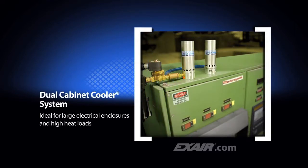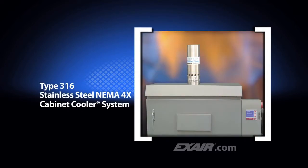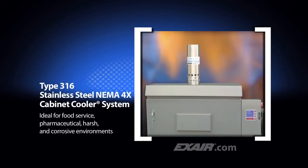Dual cabinet cooler systems are available with cooling capacities up to 5600 BTUs per hour, which is 1411 kilocalories per hour. The high cooling capacity is ideal for large electrical enclosures and high heat loads. Type 316 stainless steel NEMA 4X cabinet coolers are suitable for food service, pharmaceutical, harsh and corrosive environments, and other applications where Type 316 stainless steel is preferred.